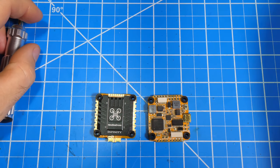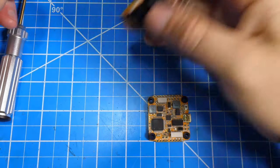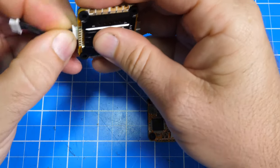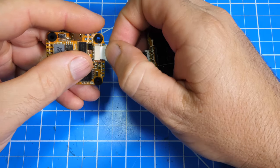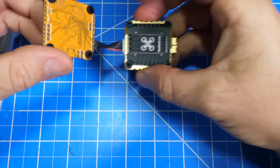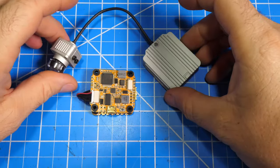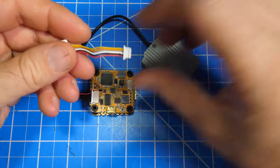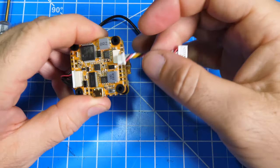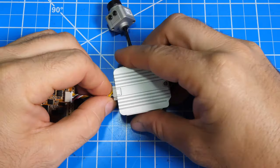Now I'd like to show you how to connect the stack to the DJI air unit. First, I'll go ahead and connect the ESC to the flight controller. Just connect one end of the included harness to the ESC, flip the cable 180 degrees, and connect the other end to the flight controller. Next, I'll connect the stack to the air unit — choose the appropriate included harness. I like to twist my wires to keep everything tidy. Simply connect the small end to the flight controller and connect the other end to the air unit.